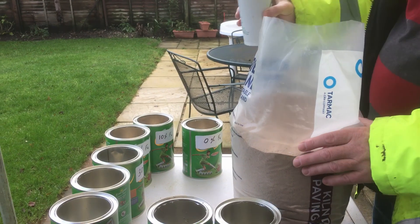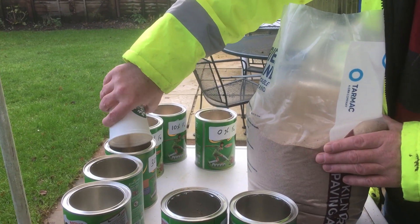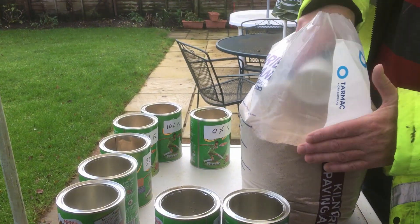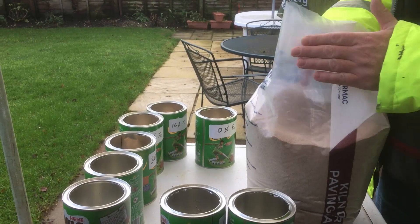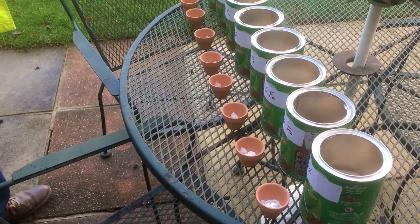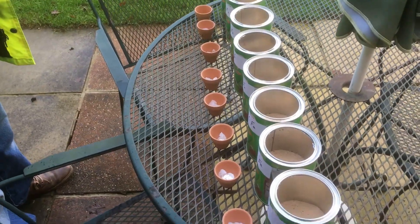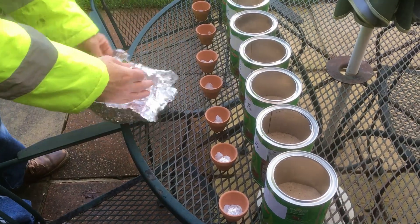It was at this point that I decided to try to determine what the yield would be from adding different percentages of iron granules. I had seen a YouTube video of someone making a sword where he added 10% of steel or iron granules, but I wasn't sure if that was the percentage that gave the maximum yield. Also, having an approximate yield would make it easier to estimate the total weight of thermite required, so I decided to make some small scale tests.